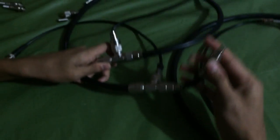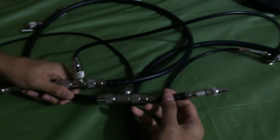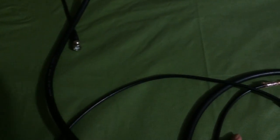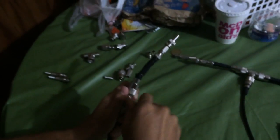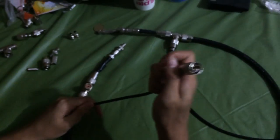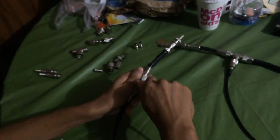As you can see, this is the terminators connected by BNC female and RG58. This is the T-connectors. The central wire is made out of the RG8 — the big stuff — it's really hard to peel. And here is where you connect. This is a sample of the RG58 with the PL259 on one end and a BNC male on the other end — that's for connecting the computers.